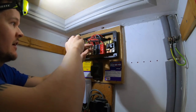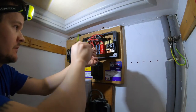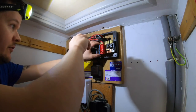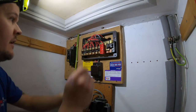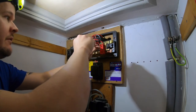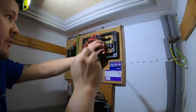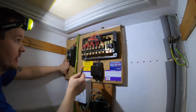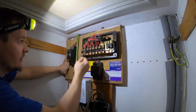Yeah, so just taking these guards out for now, and then I'll make a note of what these cables are on, they correspond to the old circuit chart there. And then we'll start doing some dead testing, go around and plug everything, etc. I won't obviously document it all because it's too much to document, but you can see the old board here, lots of flashing been going on in this one, blowing out, so that's probably a ring circuit.